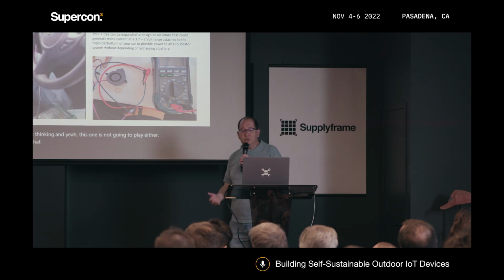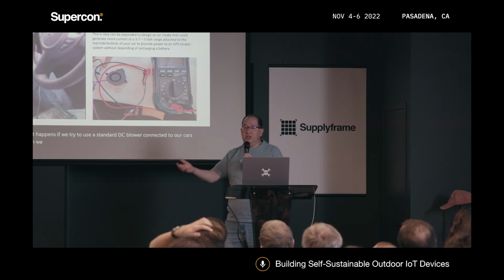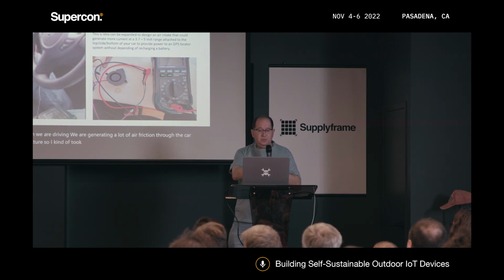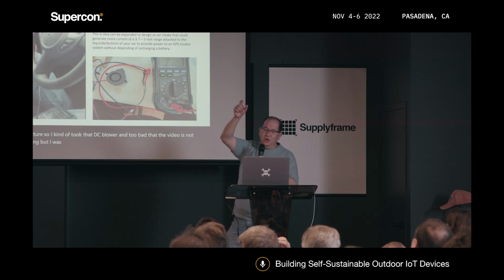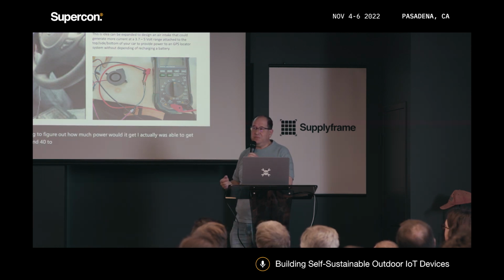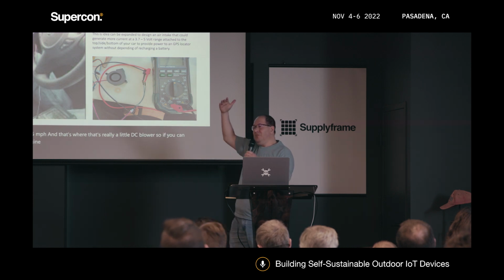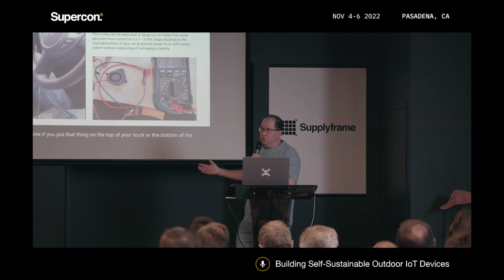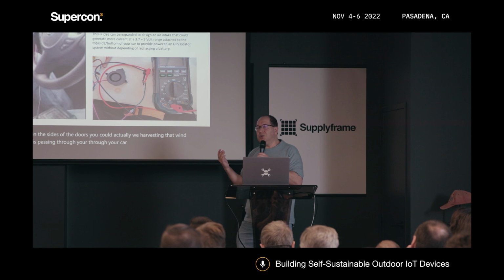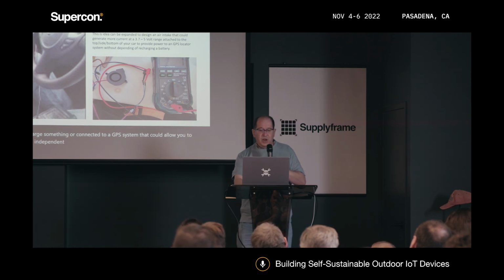So the other thing I was thinking, and yeah, this one is not going to play either. What happens if we try to use a standard DC blower connected to our cars? When we are driving, we are generating a lot of air friction through the car structure. So I took that DC blower, and too bad that the video is not playing, but I was driving, putting the DC blower through the window and trying to figure out how much power it would get. I actually was able to get around 40 to 47 milliamps at 65 miles per hour, and that's with a little DC blower. So if you can imagine, if you put that thing on the top of your truck or the bottom of the car or on the sides of the doors, you could actually be harvesting that wind that is passing through your car structure, and I don't know, recharge something or connect it to a GPS system that could allow you to have independent battery tracking location.